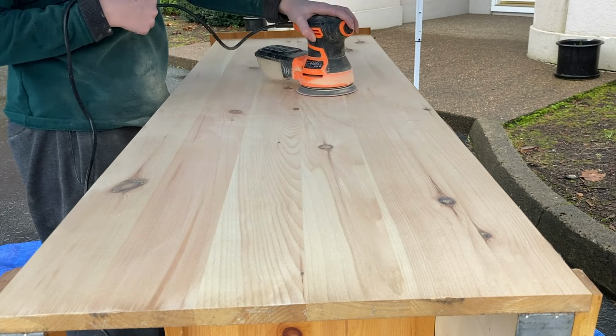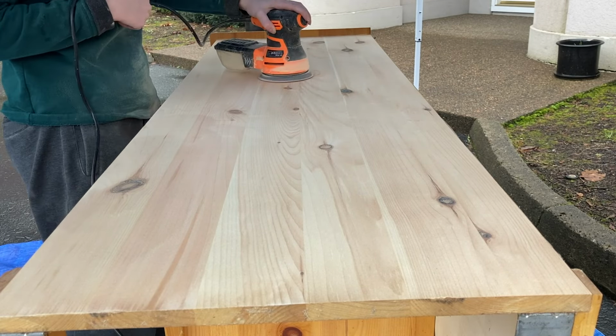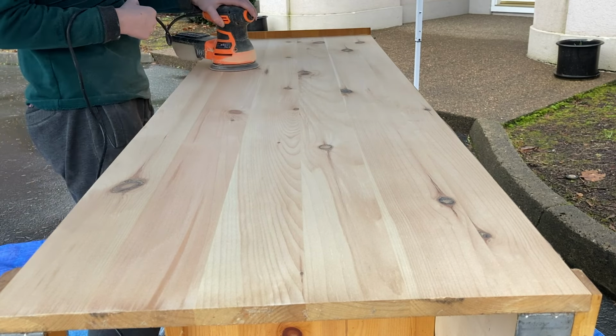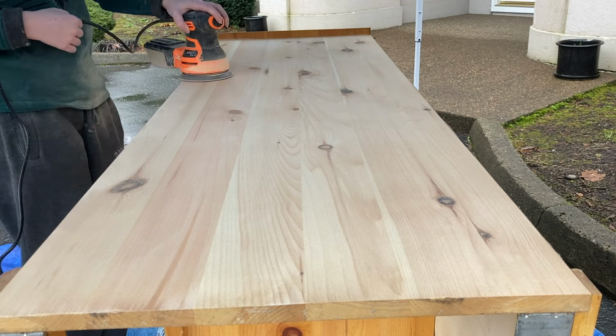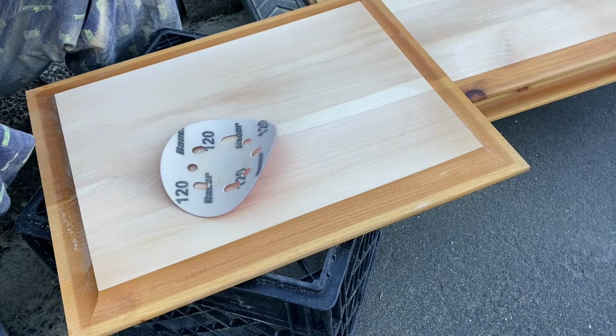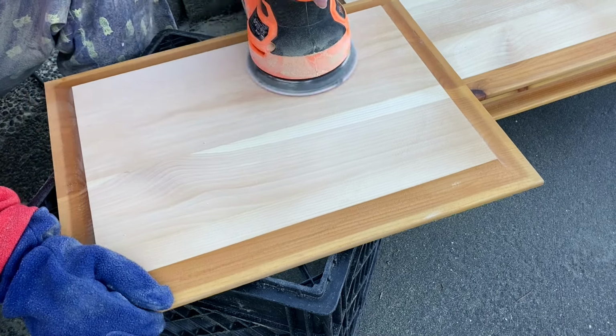If you ever see swirls in a finish, it was because they did not use a higher grit sandpaper to smooth it out as they went. You always need to graduate to higher grits to smooth out the wood after you have stripped down the finish.